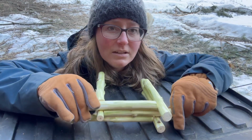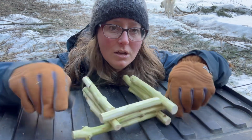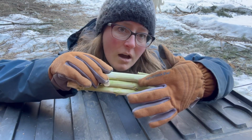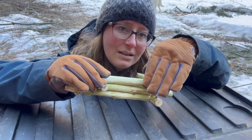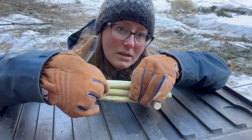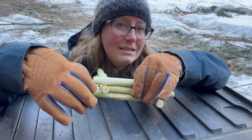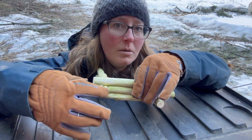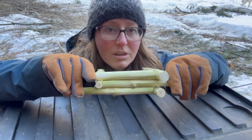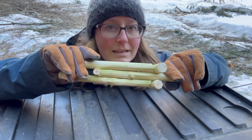Now, some of the other styles, like the Swedish cope is one of the other ones, where you actually are cutting into the log on the bottom so that it rests on the next log without any gaps, and then you have to notch the end kind of with the arch so that it fits perfectly snug around the log below it. And it does look nice. Like the logs look really nice when they go together like that. But it's a lot more work.